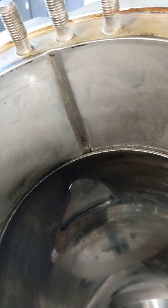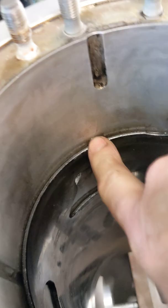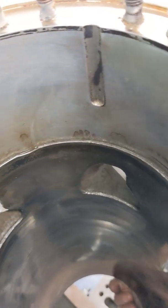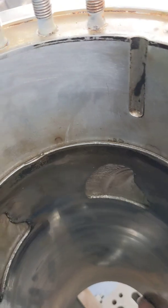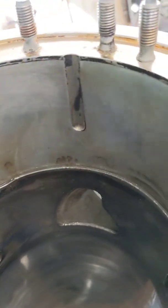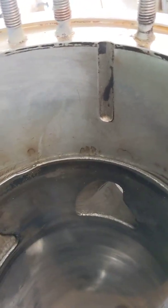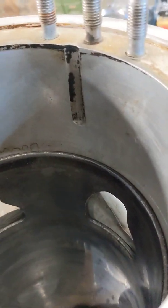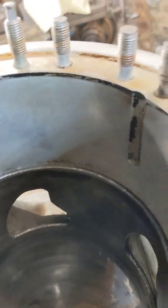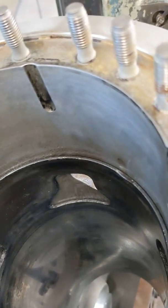The piston is coming to the top — sorry, the piston is at top dead center at the end of the exhaust stroke. On this side you can just see a bit of daylight as the inlet ports are just starting to open. Then as the piston starts to descend, the sleeve is ascending — they don't always run in sync, and at other parts of the stroke they are in sync, which makes it quite a challenge to balance. You can see one, two, three open inlet ports — they open a lot wider than that but I can't rotate the sleeve any further.